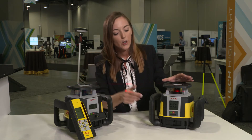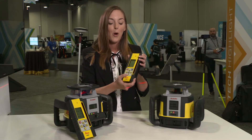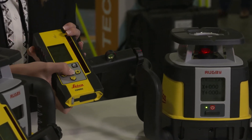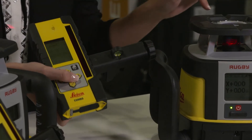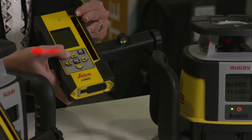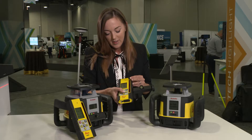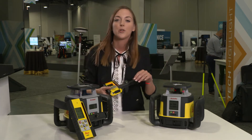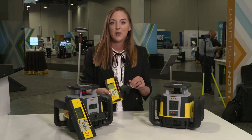The crew can basically just turn it on, and the foreman who has the receiver remote combo can set the unit to the desired status. For instance, he can change the rotation speed on the unit — and you will see in real time that the laser adapts to the settings — and he can set the grade to whatever is needed. He takes the receiver remote combo back to his pocket, and the crew works with the laser but cannot change any settings or make any mistakes on site. This is the simplicity that we focus on.